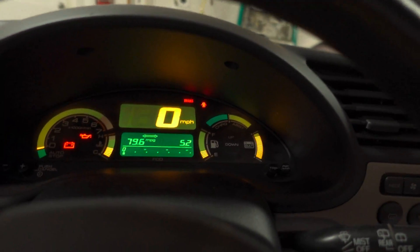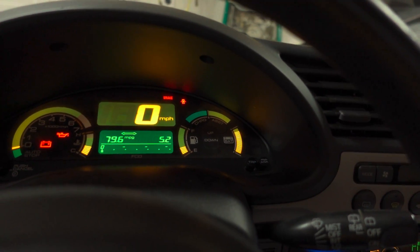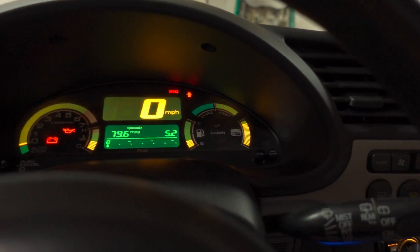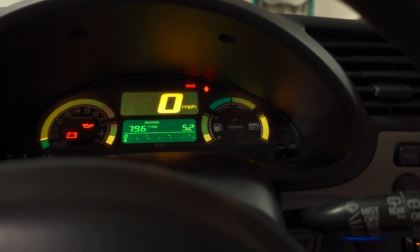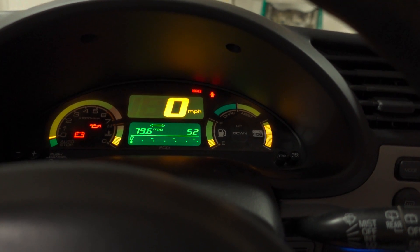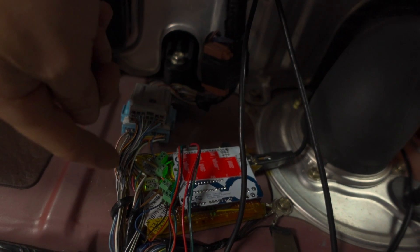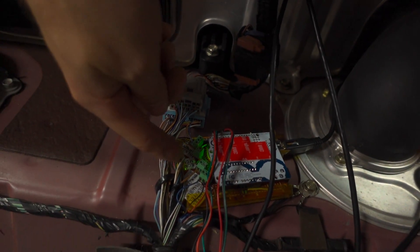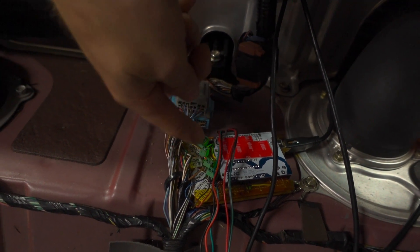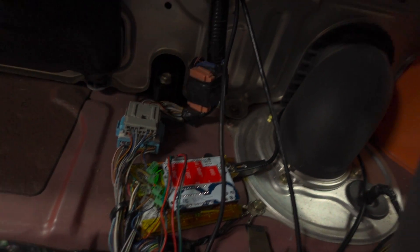So anyway, I am super impressed. I know again that I am not the first person to do this — Mike and Peter and there's like five versions of this, I'm sure. So there's the battery light — I wasn't getting that before. Anyway, as far as a 0.1 firmware, working pretty well. I think that if someone wanted to take this and design this PCB down to where it was really, really small, it would basically just tape in line here. You'd cut the five wires you need to cut right around here, and then you'd hook them up here and there — these on one side of that PCB and these on the other — and then you'd just wire it directly in line.